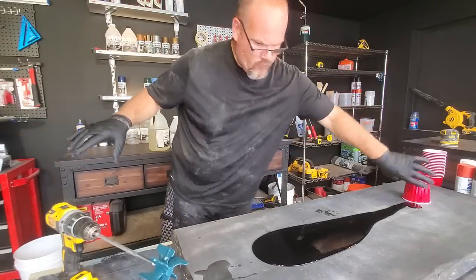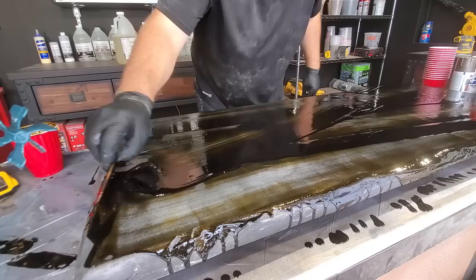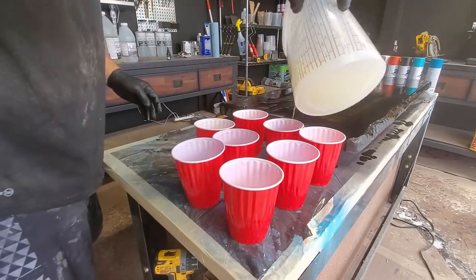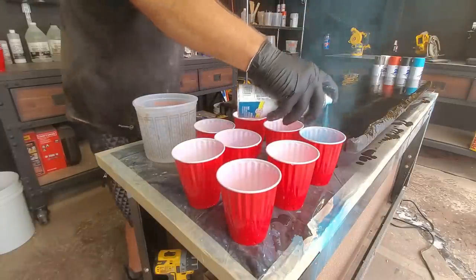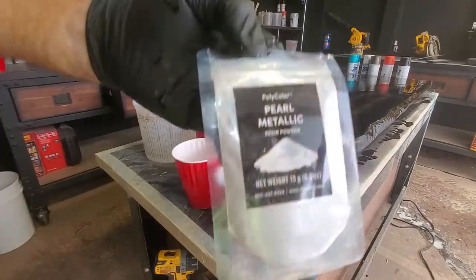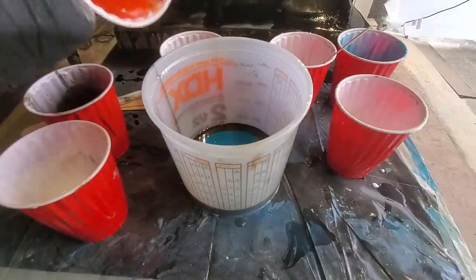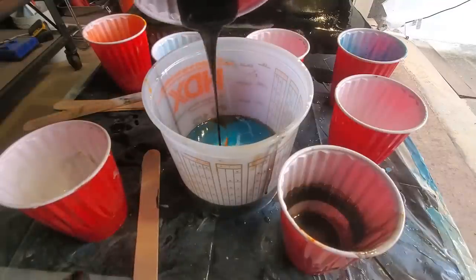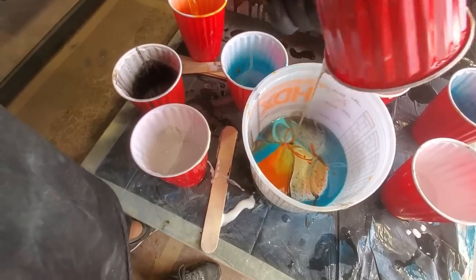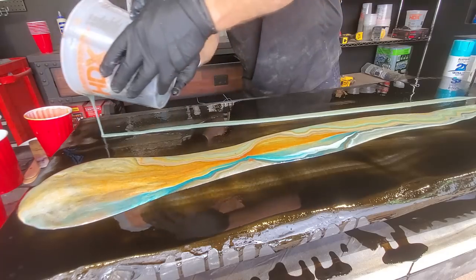Now that I've mixed my clear coating, I'm going to add a little bit of a wash coat color — this is going to be our brown dye. I'll spread it over the surface with a popsicle stick so my colors will slip and slide and I won't have any dry areas during my exotic pour. I'm putting out cups for every color I have, then adding our clear platinum product and finally the additives. In this case I'm using a lot of different spray paints directly into the clear platinum, along with some metallic powder and dye. I love the pearl metallic powder in conjunction with white spray paint. What you get with spray paints and metallics is that they oppose one another and create different formations in your coating that look like natural stone — like it was created by mother nature herself.